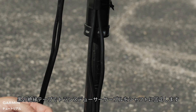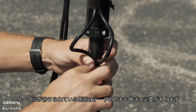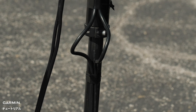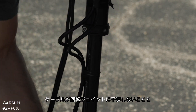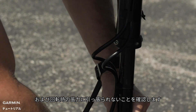Use the black electrical tape to secure the transducer cable to the shaft. The split section of the cable should extend under the tape. Finally, test the full rotation of the trolling motor to ensure the cables clear the rotating joint and are not pulled due to tension during rotation.